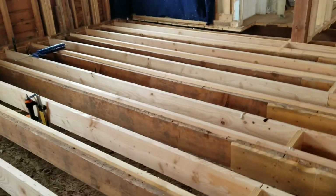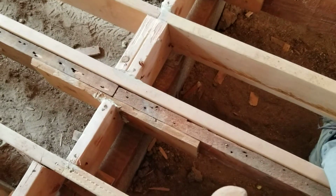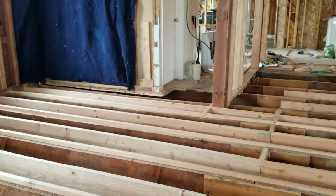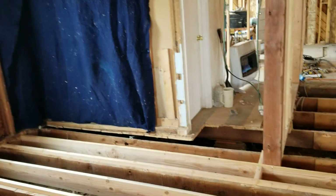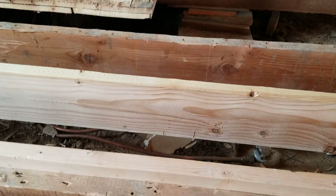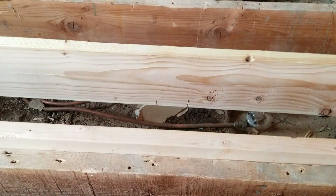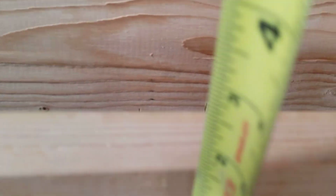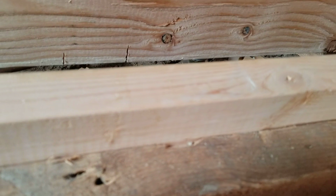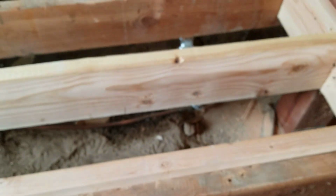So anyway, now let's look at the floor. Like I told you, that first joist was about 1/4 inch low. Well, now look clear over here on this one. Let's come over here to this saggy, awful, nasty spot. Right here. That ain't no 1/4 inch right there. That's almost, it's 1.5 inches. Let me focus my camera again. Okay, that's 1.5 inches.